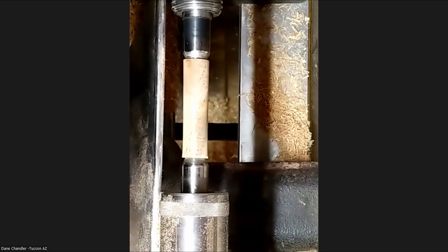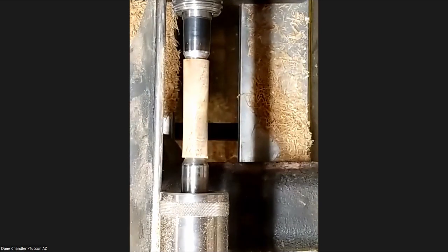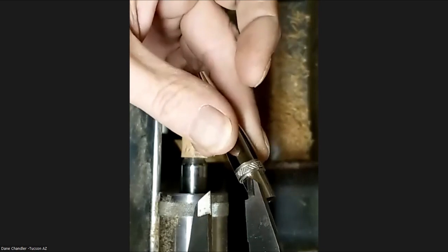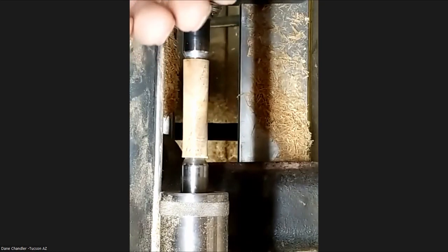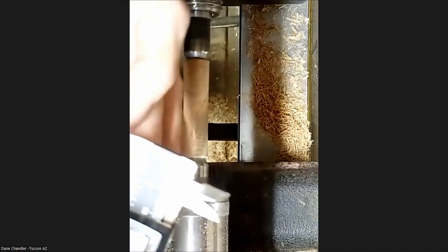Now, let's take a look at the nib side. You're going to measure where that union is going to be between the blank sliding on and the metal part of that cap. And they're supposed to be the same dimension, especially if you're just looking at the bushing, because the bushings come as a set of two and they're both supposedly the same dimensions. And that dimension is 11.97.